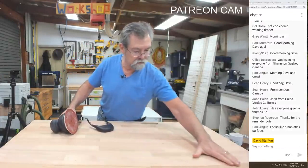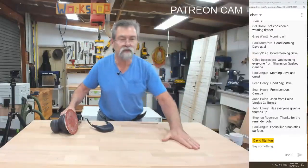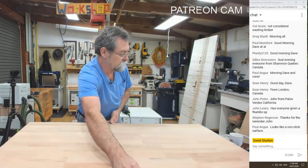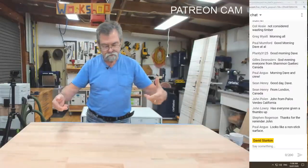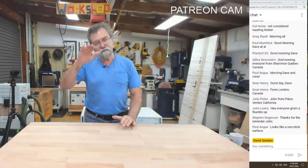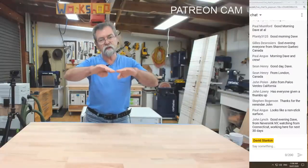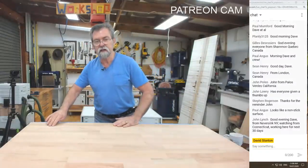And over the back here, there's a couple of little spots. You know what, I might turn it around so you can see it better when I do that spot. It's just a little bit, because these boards, when you buy them, they're not totally level all the way through. This is all end grain finger jointed. And then once it's all been done like that, they throw it through this big drum sander and it can be uneven. So when I'm joining it, I cut the sides off. I might take a whole lamination off so that I'm not right on the edge, because those big drum sanders tend to roll over on the edge where there's less resistance. So just here, I need to sand that.